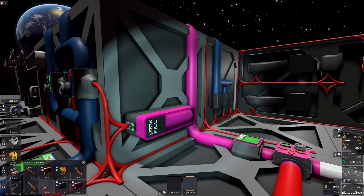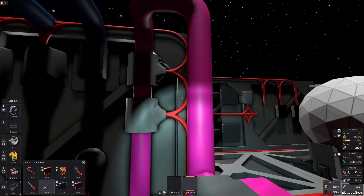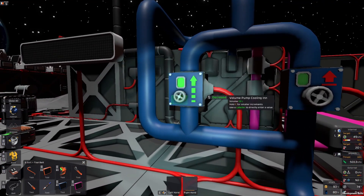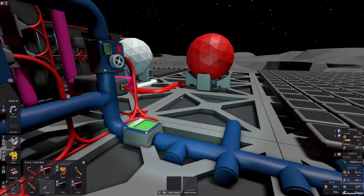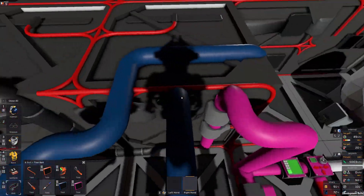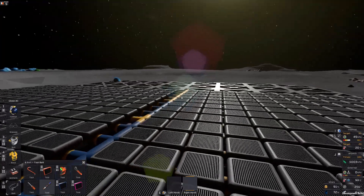If I remove this box, you can see it just goes into the passive vent and the active vents send it back out. This volume pump is controlled by a PID controller so it self-tunes exactly how much throughput it should have. How many radiators you need will depend on what type of gas you use, what the pressure is inside, and how much airflow you can deal with. This setup is actually not enough — and that's because I want to show you how to determine exactly how many you need.